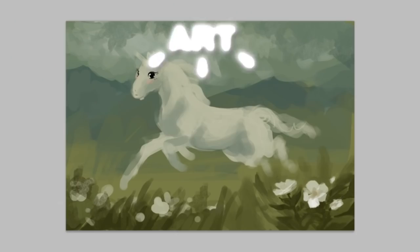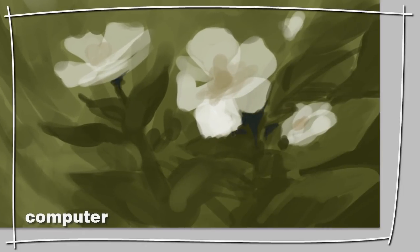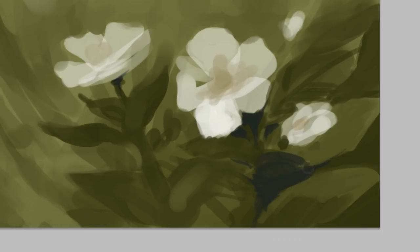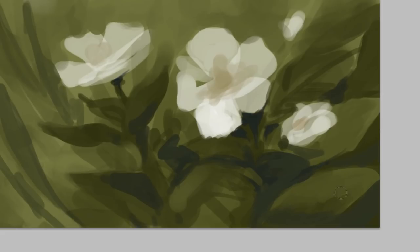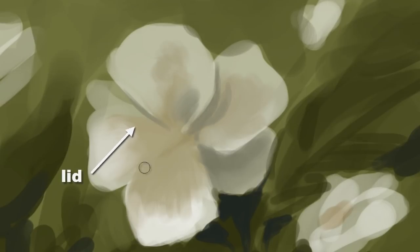Every sticker begins with a work of art. The artist transfers the image to a computer and manipulates it until the desired effect is achieved. Next, a sheet of photopolymer goes onto an exposure machine. The technician places a negative of the art on top of the photopolymer sheet, pulls plastic over the tube, and closes the machine's lid. Inside, a vacuum pulls the negative to the photopolymer, and intense ultraviolet light transfers the art to the photopolymer in seconds.